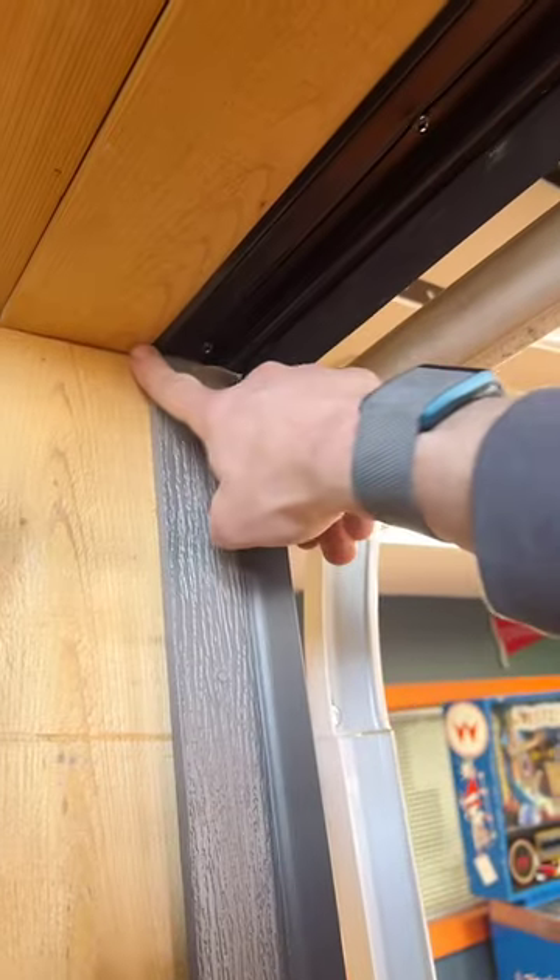The big thing about all of this is it is a garage door. There are specifics to how a garage door moves along the wall, but the expectation of this door being completely waterproof is not realistic. Water can seep in at the bottom. Even with thresholds, there are some designs that can really stop or prevent water, but it's never going to be a waterproof scenario just because of how the garage door plays. Even some of the corners, there are going to be little tiny gaps here and there. We try to get everything buttoned up so there's no daylight coming in, but we're talking about a big moving wall going right behind another wall. We are going to be able to get everything tightened so that insects, pests, and rodents are deterred and not coming into the garage, but that means we need to maintain our weatherstripping and seals and make sure everything is buttoned up on an annual basis.